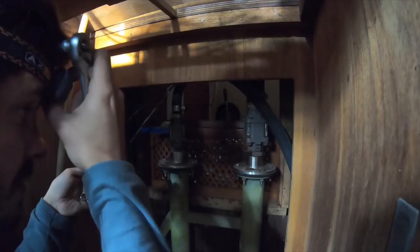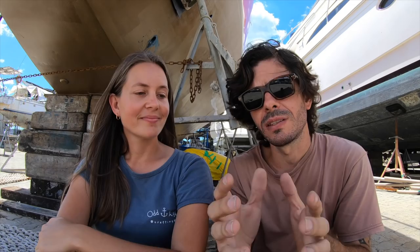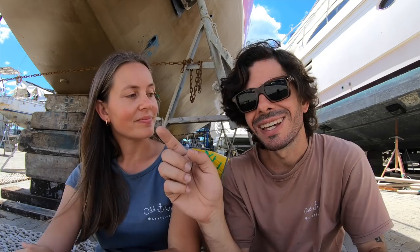Yeah, actually not just to the bow. We're gonna have a saltwater pump inside of the boat using the through hole of the diesel generator that we're not gonna use for now. So basically we're gonna have the water coming through the through hole of the diesel generator, going through a saltwater pump, bringing it to the stern of the boat, up to the deck, and we're gonna divide it in two. One is gonna stay on the stern, so we can have water on the stern to clean fish and feet and everything you need. And from there, we are gonna have the hose going inside of the tube of the railing all the way to the bow of the boat.